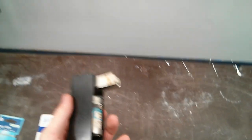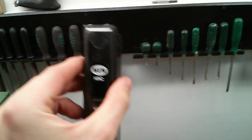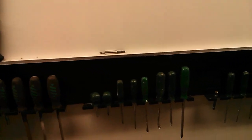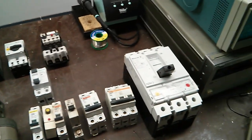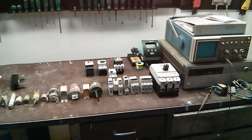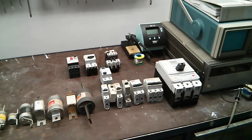There's a carrier there for a BS88 fuse — it just screws in, then you take it into the box, push it in, the pins make contact, and you close the lid and turn it on. That's how those work. That's just an example of a fuse carrier. All in all, that's most of our fuses — I'm sure there's loads more out there. If anyone else wants to add more they're more than welcome to make a video of their own. Hope you enjoyed it guys and I'll see you next time. Bye.